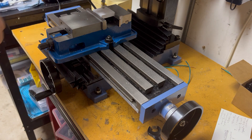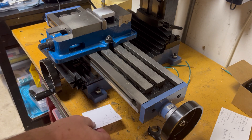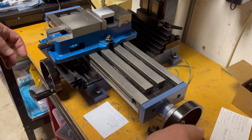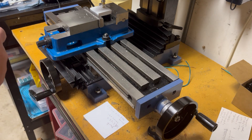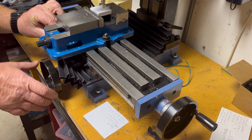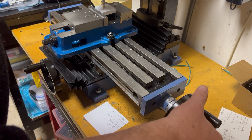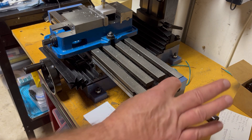Here's an example of using the mill in the normal manual mode. Parts of this video are sped up, so I'm not really turning the handle as fast as it looks. To move metric distances I had a whole bunch of calculations to work out how many turns I needed to do - something like 12 turns and 37 graduations to move about 20 millimeters. Same thing for the y-axis - I had to count the right number of turns and graduations, then go back on the x-axis counterclockwise 12.37 graduations. A lot of counting and things to keep track of.